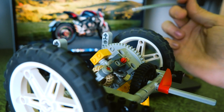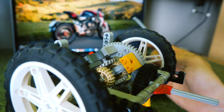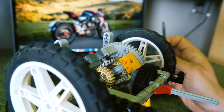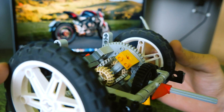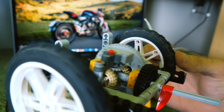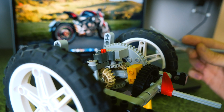That's the drawback of an open differential. But it is the cheapest solution, and that's why each car has an open differential unless there is some need for a different solution, like in a sports car where there is a limited slip differential. I imagine it wasn't very easy to come up with this idea, but once you understand how it works, it is a very simple design and yet so beautiful.